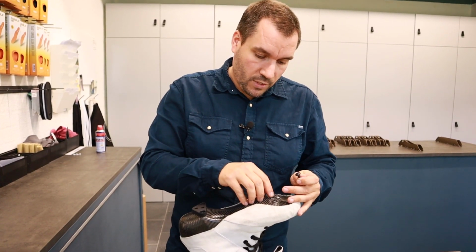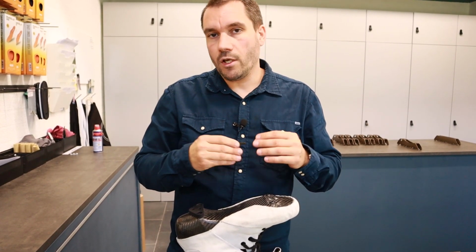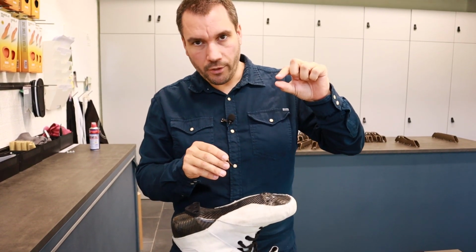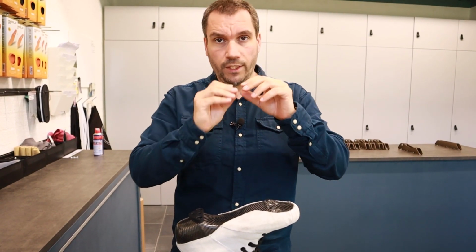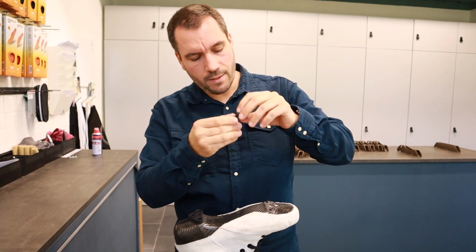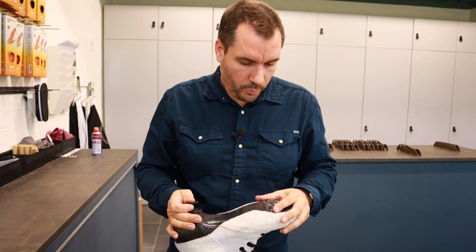When something happens that it breaks, that means the bolt is not long enough, so it's only hanging on to the top part. That's not good, because they are aluminium. They have a lot of strength when they are fully through, but when it's only hanging on like 2 or 3 of these threads, you know, it's not the right way to set it up.